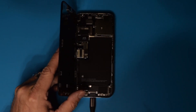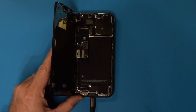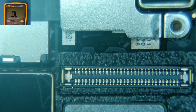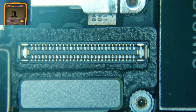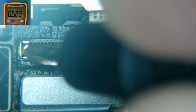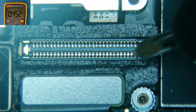This has already been opened up, so we're going to check right here where the display connector plugs in and see if we can figure out why we're not getting an image on the screen. I've got my multimeter in diode mode. I'm going to put my red probe up here where the SIM card holder is. On the right-hand side we should have ground, and over here on the left-hand side we should have about .522. I'm going to start here from the right on the bottom row and go across.